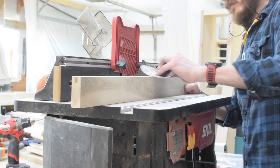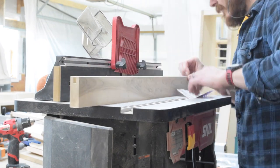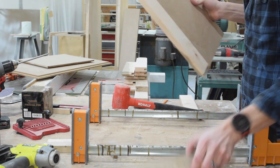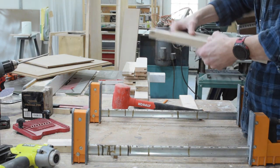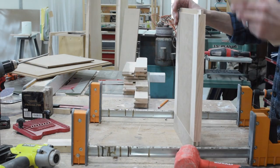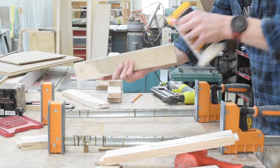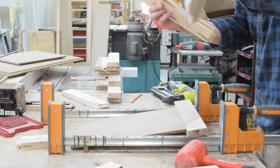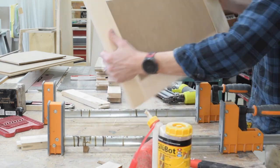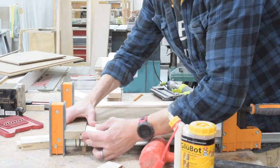A nice little trick for improving the quality of the paint job — it starts way back before you assemble the doors. I take a 1/16th roundover bit and round over the inside edge of all my rails and stiles for the shaker doors. What that's going to do is help prevent paint bridging or building up between the rails and stiles and the panels when I paint, and it allows it to be easier to keep a nice little shadow line all the way around — allowing the door panel to float but also having a very clean line all the way around.